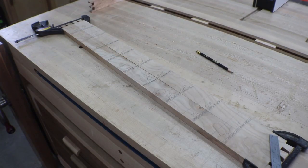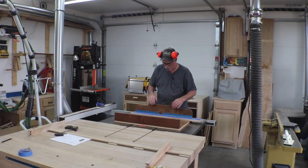All I've done here is laid out per the plans where the shelves go. The shelves are each five-quarter shelves and I'll get that material out in a bit. The darker lines you see indicate how the shelves mount - they're actually going to be quarter-by-quarter inlaid ebony, and then the shelves will be notched to sit on those ebony runners. Next up we're going to groove those quarter-inch by quarter-inch runners and also groove for the back, and then I think we can glue up this case.